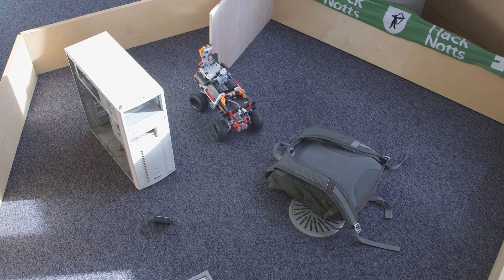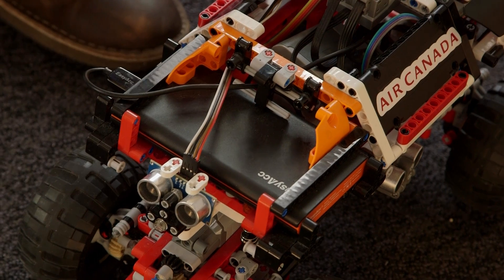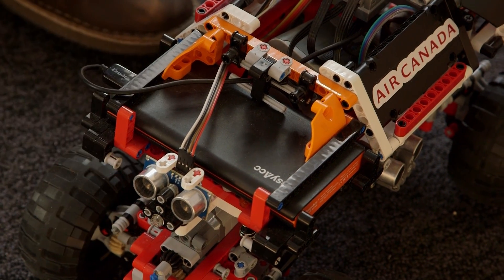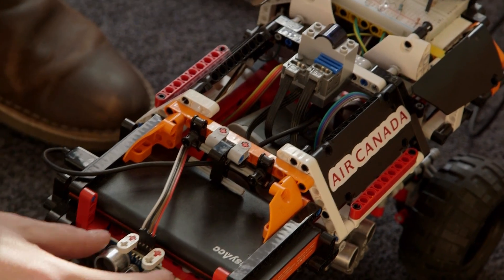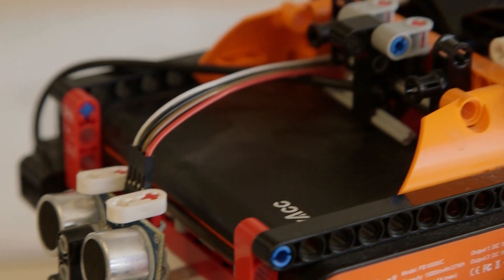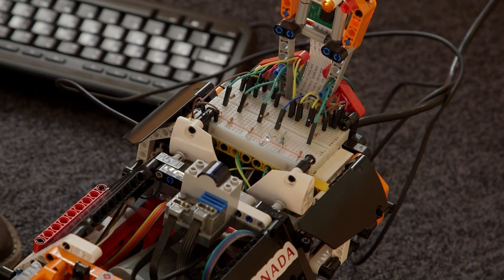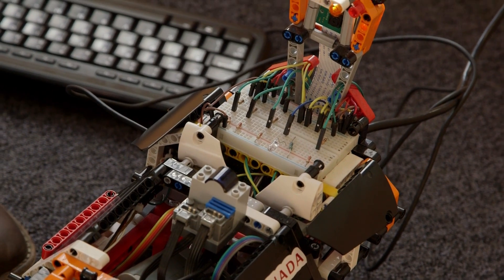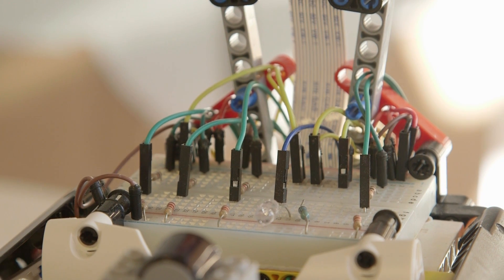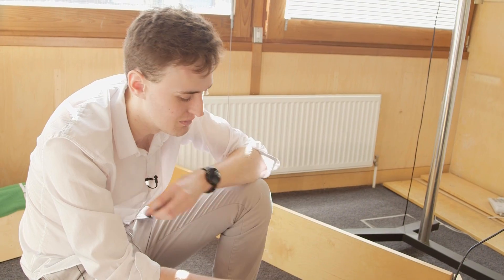It's a Raspberry Pi Model B with the standard operating system — I think they call it Noobs. In terms of wiring, each sensor has a ground and a five-volt rail, plus input and output signals. The white wire sends a signal to pulse the sensor and the black wire receives a signal back. Each sensor has four cables powered and controlled by the Raspberry Pi underneath the breadboard. We would have soldered this together but we were rapid prototyping and just wanted to get something that worked.